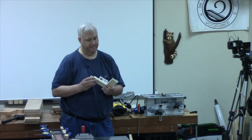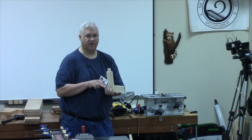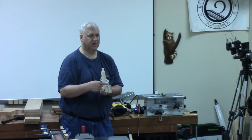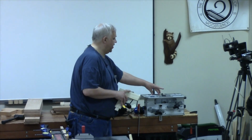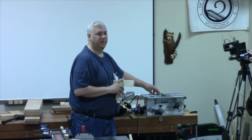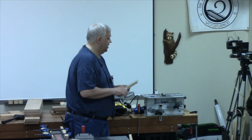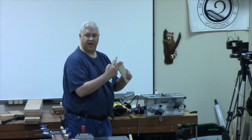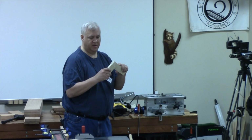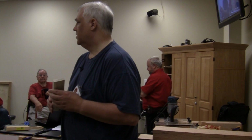Yeah, you can do double mortise and tenons where they're double side by side on wider stock, or doubles lengthwise. You can also do longer mortise and tenons by using the stops, the left and right stops on the top of the table, to have it repeatable. You can use it for bridle joints. You know what a bridle joint is? Where you cut a slot in one piece and then basically it fits in the end. It'll do bridle joints as well, haunch joints. And doubles I hope never to do.